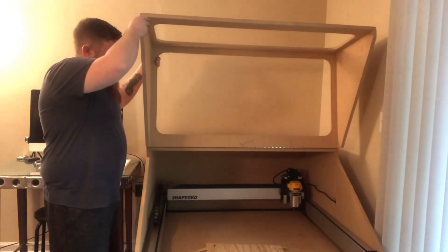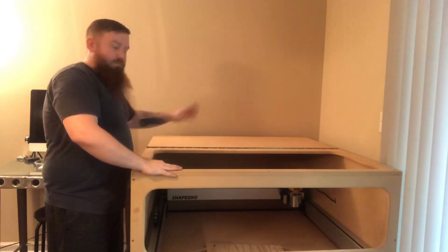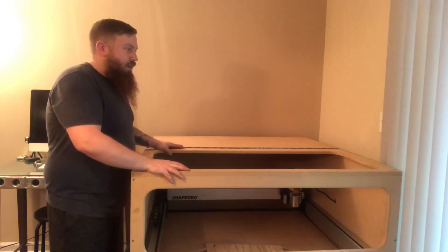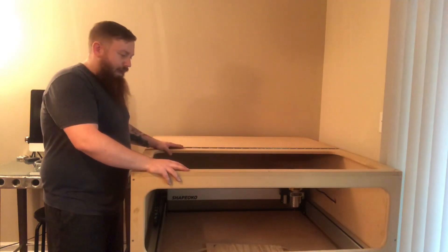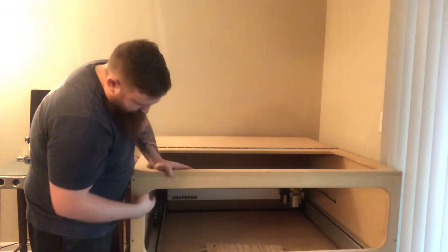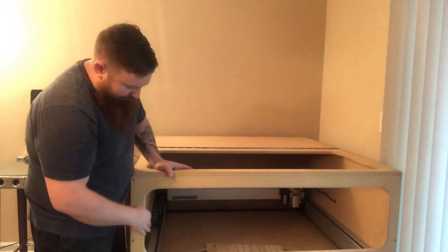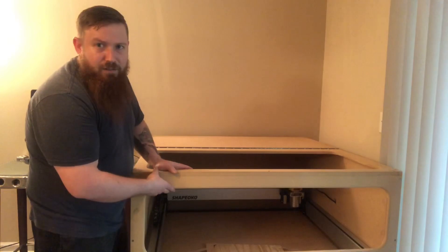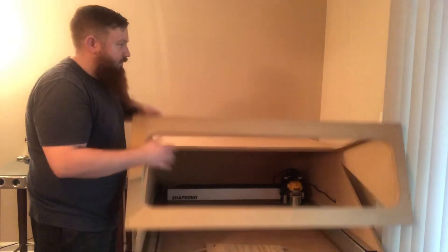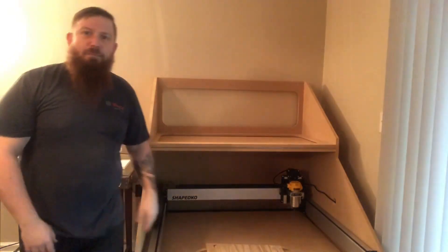This is how it opens. All these cuts I just made with a circular saw — I drew out my line, clamped a straight edge down how I wanted it, and cut right across. Even the windows, I just made plunge cuts with the circular saw and cut them out. I used some grinding wheels to get the radius and ended up cutting that out with a jigsaw. Really nothing too fancy — just designs I came up with in my head.